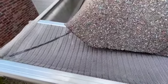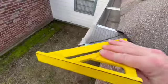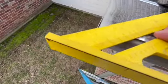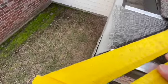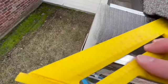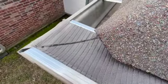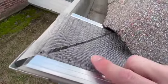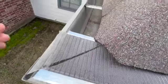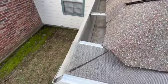This is going to be the hardest part of the job. I got it set here using a 45-degree triangle tool. I lined it up as far as it would go to decide where to stop my piece, then made a 45-degree mark right here. I used a permanent marker to draw on the mesh — that's where I'll need snips, which the directions mention. I'll take this piece out, cut the 45, put it back in, and then cut the 45 on the next piece as well.